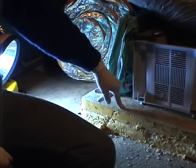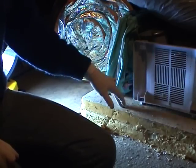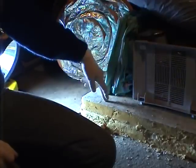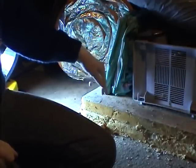Where I've got stuff stored in the loft, I've actually put extra insulation as these sort of fancy, I think they're polyisocyanurate foam sheets. You can buy something similar to that in your usual DIY place. If you've got to board your floor out, something like these rigid sheets are sort of the answer if you need to store stuff and still get a decent insulation level.